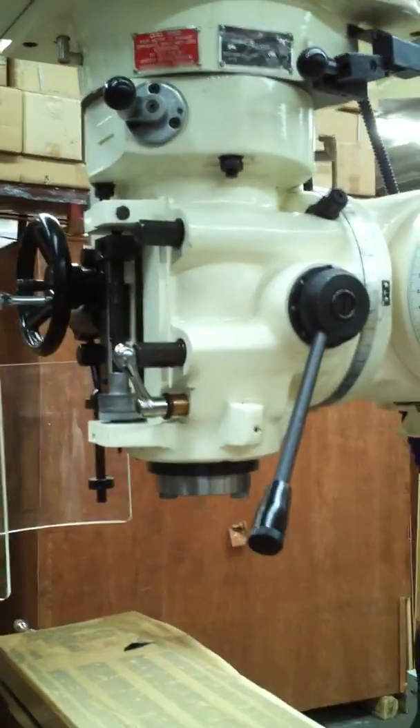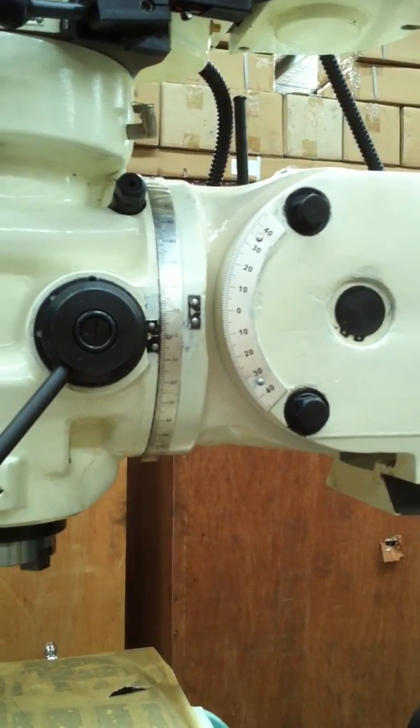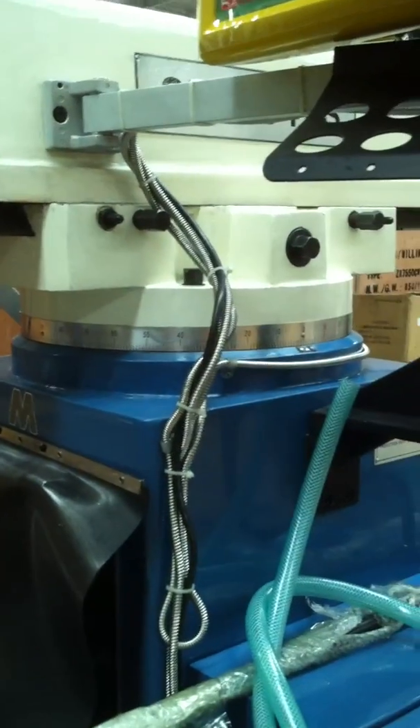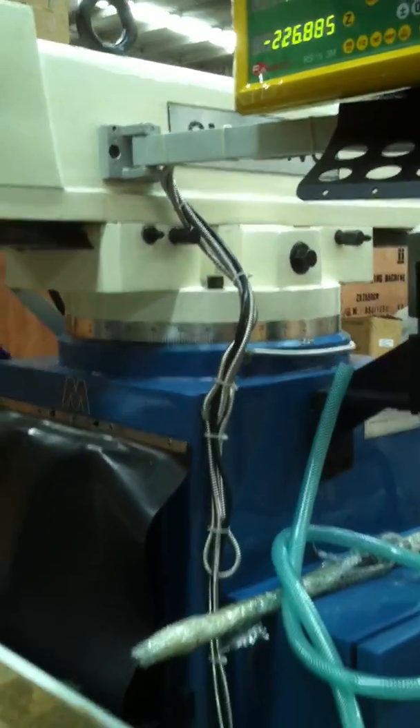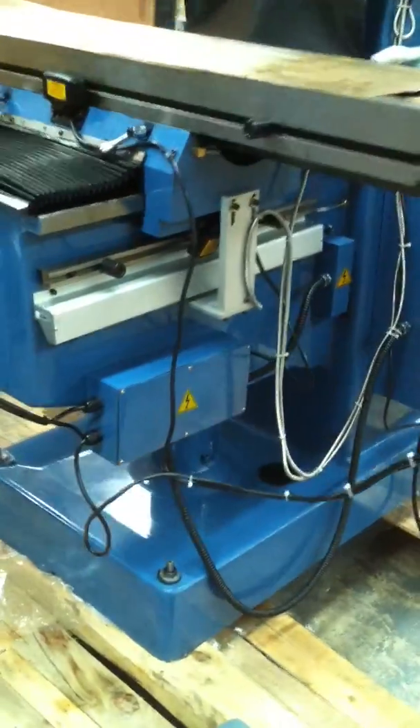Safety wise, very good for today's safety conscious workplace. As you can see here, we've also got a braking system, quill feed, the variable speed drive, and the 2-axis swivel with tilting forward and reverse. You can also rotate your head on the KD4, and we've also got a power knee for up and down movement on the knee of the machine.